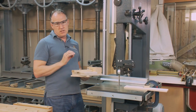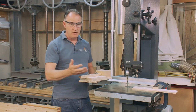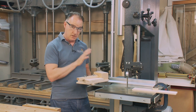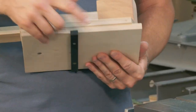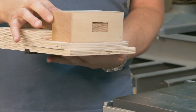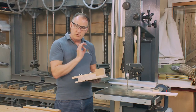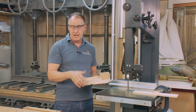Jig making takes some time, so it's only worth doing if you've got 10, 20, or 100 of a particular piece to make repeatedly. We will also use this same jig with a slightly different positioned mitre slot on our disc sander, and again we will just swing this across the disc sander - it then requires very little hand finishing to make these a complete head for the mallets.